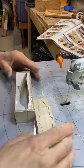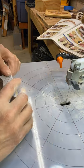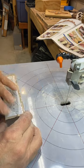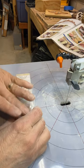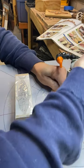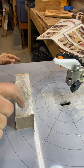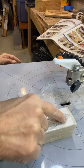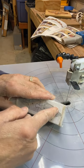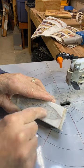I have cut the side profile. I've taken out the pieces and gotten rid of the excess sawdust. I'm going to put it all back in, use clear packing tape around the entire piece again, and now I'm ready to cut the individual puzzle pieces out. Make sure you change your blade — that's an awful lot of cutting for those two blades. On blade number three I'm going to be cutting my first area marked number one. On this first inside cut I'm going to be coming in at 90 degrees to get to that first area.